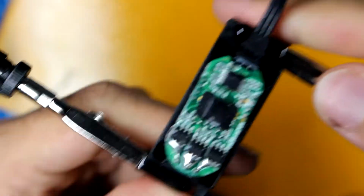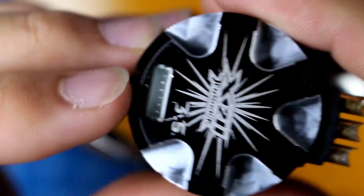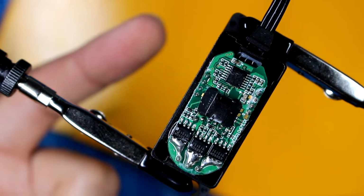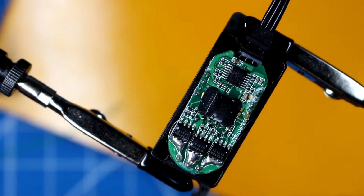So there's 6 pins, which is exactly the same as any standard brushless motor sensor. So if we look here on this one, there are 6 pins. Now the order of the pins, I believe, are ground, temp, encoder phase A, B, C, then VN, which is in this case roughly, I think, the servo voltage, which is 5 volts. The sensor portion runs off of 5 volts.